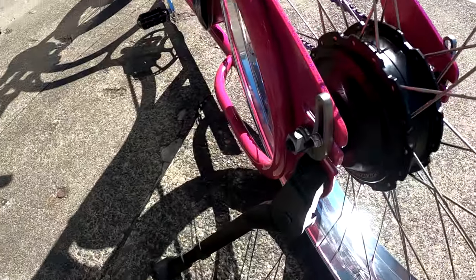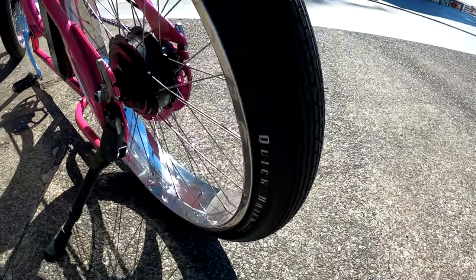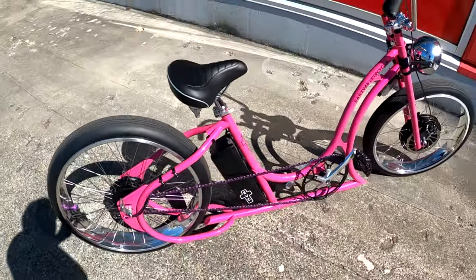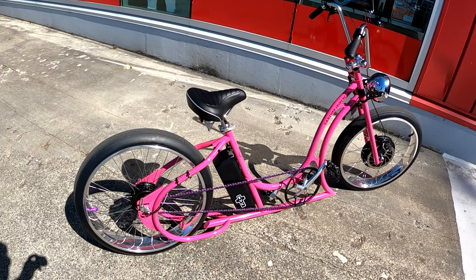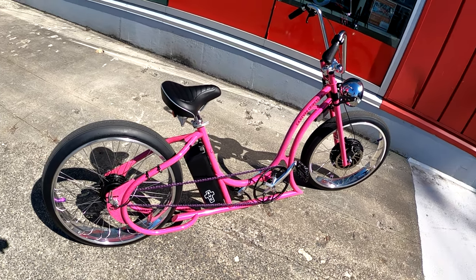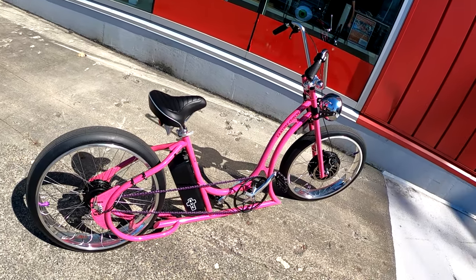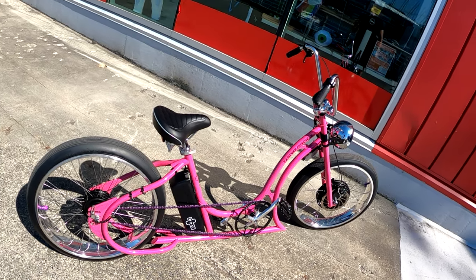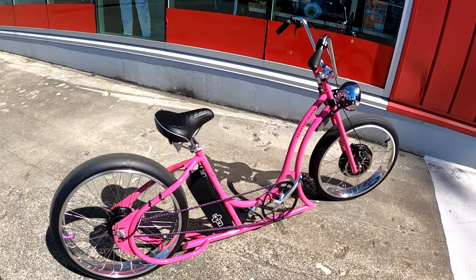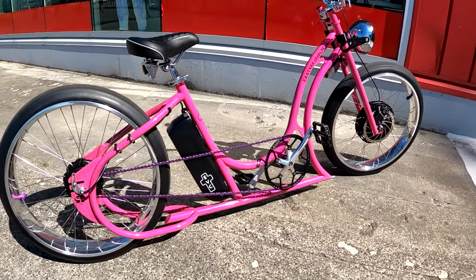And then of course on the side, same thing, right? Dual torque mounts. I'm running the Quick Brick tires on this one. I thought it looks cool, gives it that retro look with that pattern, and that gives it the dual motor setup. So with this setup, I'm running front direct drive, rear geared motor, and it's about 2200 watts in capacity, and I've divided that up with the tuning of the two controllers to make it operate together, giving you the maximum power and feeling and control and braking, of course, that you can get out of the bike and the components that are on it.